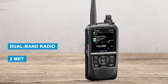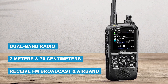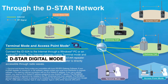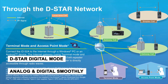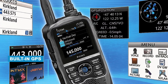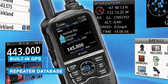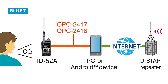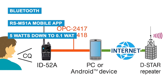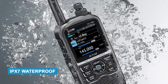This is a dual-band radio for 2 meters and 70 centimeters, but it can also receive FM broadcast and air band, giving you more to listen to. Since it's an ICOM, you get D-Star digital mode, and the radio can switch between analog and digital smoothly, even using both at once. The built-in GPS works with ICOM's repeater database, so it's easy to find and connect to repeaters wherever you are. On top of that, it includes Bluetooth, works with the RS-MS1A mobile app, has adjustable power from 5 watts down to 0.1 watts, and is built tough with an IPX7 waterproof rating.